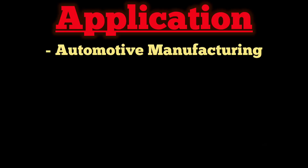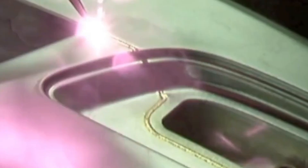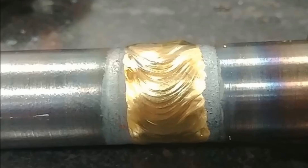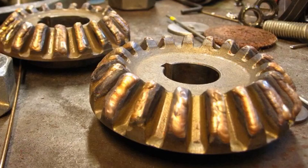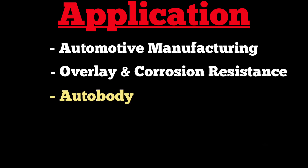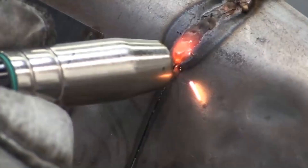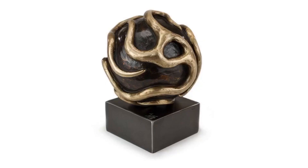Let's start talking about those applications. Automotive manufacturing uses a mixture of MIG brazing and laser brazing with silicon bronze on galvanized and high-strength steels, usually on side panels or tailgates. The second application is overlay of stainless steel shafts — anything with prop buildup, corrosion-resistant applications, or bearing surfaces; they use aluminum bronze for buildup on bearing surfaces. The third is auto body and repair, where you see a lot of galvanized material and slot and plug welds, but also open root butt joints.